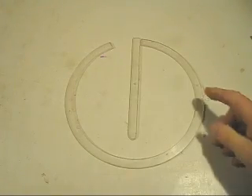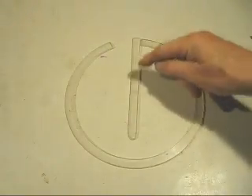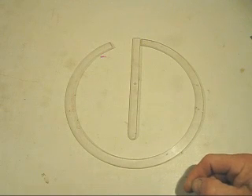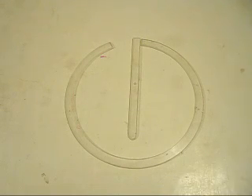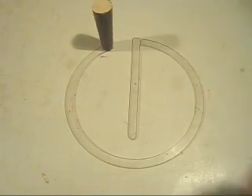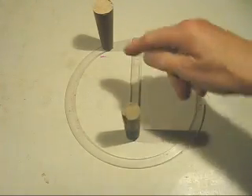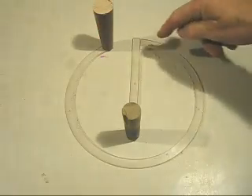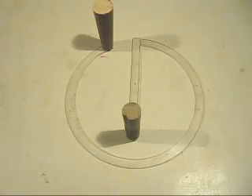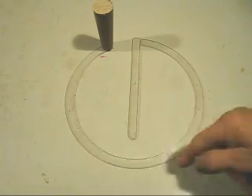Today's video is all about this pattern. It's to see how far the metal will flow using different gating methods. The first one will use a sprue with a vent so when the metal flows around it will bleed the air out. The next one will be done without a vent and we'll see how far the metal will flow.